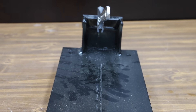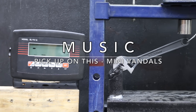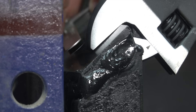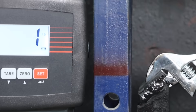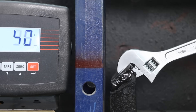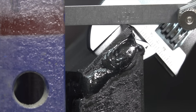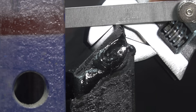A hydraulic press is used to apply 200 pounds of load to measure jaw gap under stress — the steel plate is AR500 to prevent bending. The Navagando's gap more than doubled from 0.45mm to just over 1mm under load. The Pittsburgh reached 1.1 millimeters. The Cobalt's no-load gap of 0.33mm more than doubled to 0.88mm. The Tecton's no-load gap of 0.25mm tripled to 0.76mm, taking the lead. The Crescent performed very well with the smallest gap yet at 0.58 millimeters. The imported Craftsman left a gap of 0.7 millimeters.